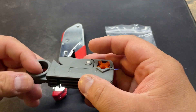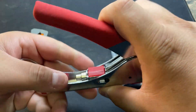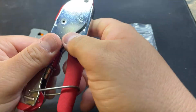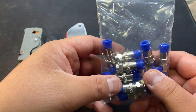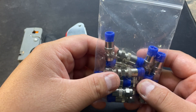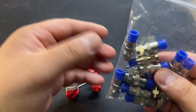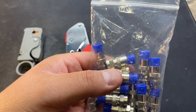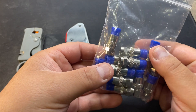It's a pretty nice little tool, lightweight and basic. Here's the crimping tool — nice rubber grip, pretty basic. The kit includes 20 F-type compression connectors. Be mindful of the application: these are for indoor use, so you may need different connectors for outdoor or moisture-rated environments. Also, these connectors are meant for dual shield cable — if you have quad shield you'll need different connectors.